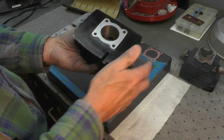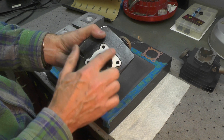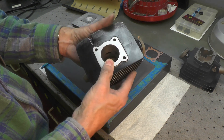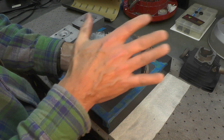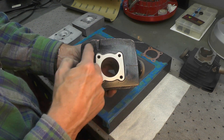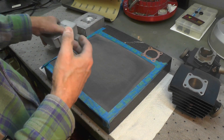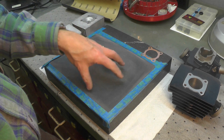If anyone's wondering why I didn't do this before painting, the primary reason I do this last is because it is last. All the other handling — media blasting and all the other work that goes into these before they get mounted on a bike — means the last thing I like to do is refresh this surface. You could do it and then paint, but you'd have to be careful about masking. My preferred way is to do this as the very last step before the parts go onto the bike. So we'll consider this video complete — any questions, notes, or comments, drop me a note. Thanks for watching.